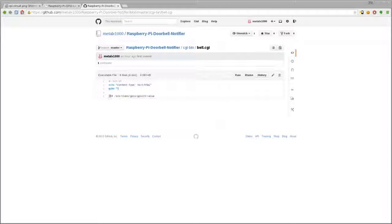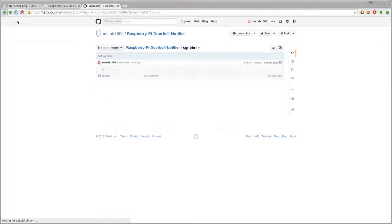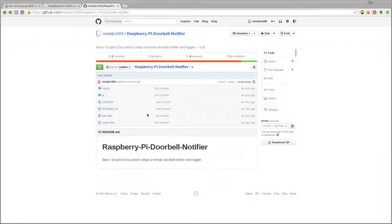After that, you just run it as a regular shell script, which in this case is catting out the value of pin 23, since that's the pin we used, which again will be a 1 or 0. So basically, our web browser, 20 times a second, if your device is fast enough to go that fast, is checking the value of that. And anytime that the button is being pressed, play the audio file.